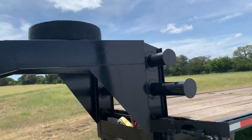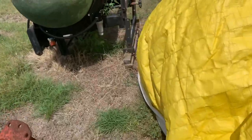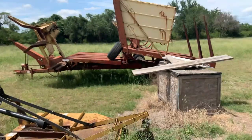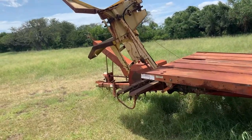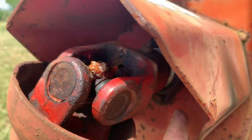I've never square baled — I've only round baled — but I do have a square baler underneath this tarp. I went through it a year and a half ago and got it all ready thinking I was going to square bale and I never did. It's a John Deere. I'll get it out and do a video. Also, this is a square bale stacker — a Stack Liner 1037. It needs some work: I went through and rebuilt the driveline on it; it hadn't been used in over 10 years. I had to replace the bearings on this driveline.